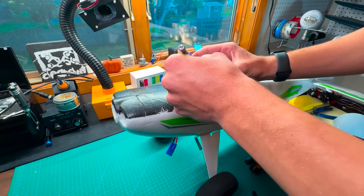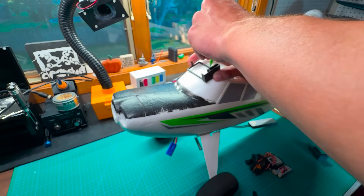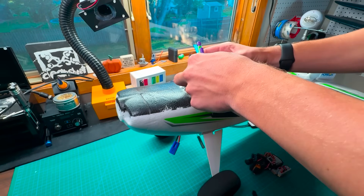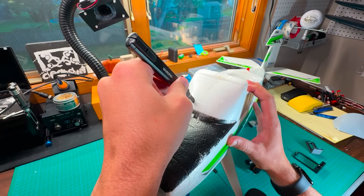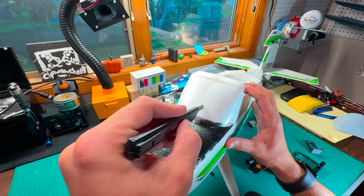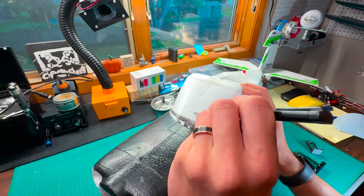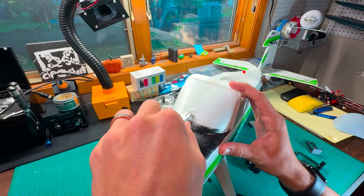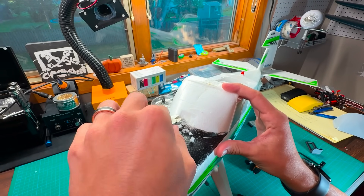With this Timber X the wings are fully removable, so I wasn't able to put it directly over the center of gravity, which is a little bit back from the leading edge of the wing. Instead I cut it as far close to this windshield piece of foam as I could so that I could place everything as far back as possible, keeping it close to the center of gravity. In the battery tray there is enough space to push the battery back to offset the head tracking system being a little further forward. The process is making a lot of horizontal and vertical cuts with the exacto knife.